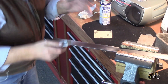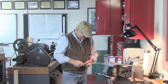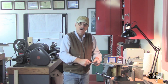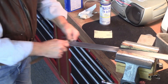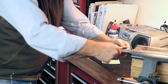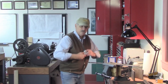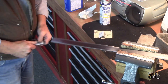Sanding this bar down — there was some kind of coating on it, pretty dirty, and I had to take my oscillating sander to get it off. Now I'm down to using the regular sandpaper I use when I polish. Right now I'm just using some 180 grit trying to get the polish up. I don't know how similar or dissimilar the two metals are, but I'm hoping to get at least some idea of how the coloring works on this. I'm trying to bring the luster up similar to the 1905 receiver. Now I'm going to get up to the 320.